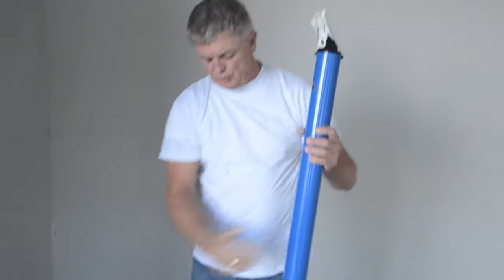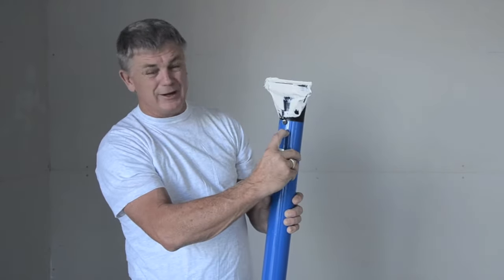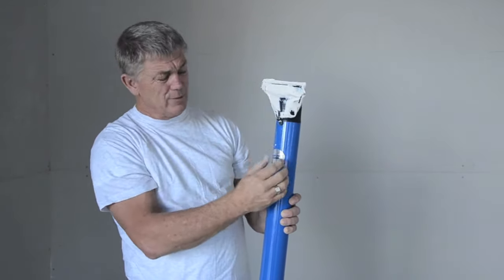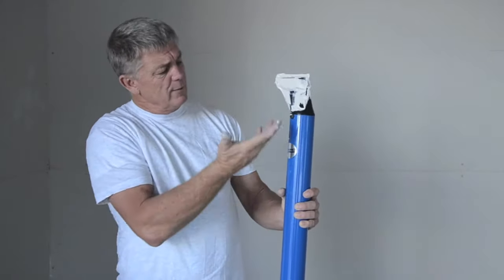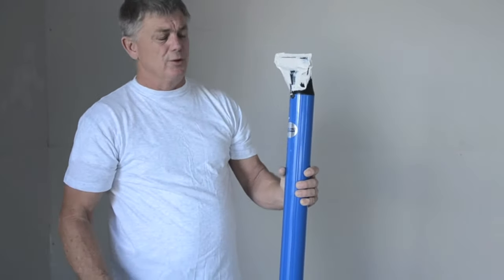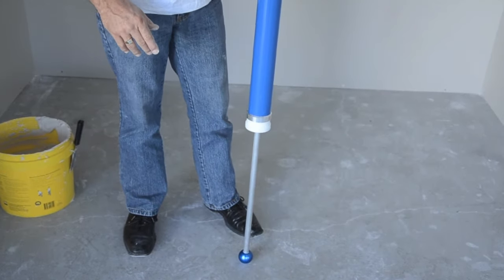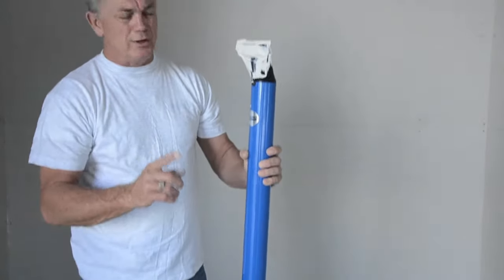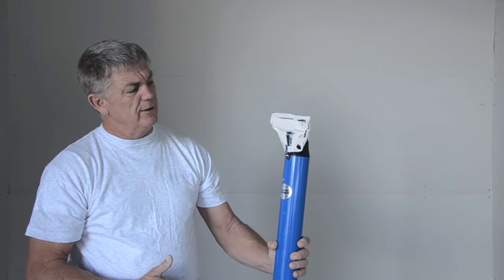Same with the compound tube — every time you put mud into it, your plunger inside, the piston, actually stops about here, so that gap is air. As you draw mud into the compound you've got that air pocket. What you're trying to do is, like burping a baby, bring the air to the top and get it out so when you're going along the joint it goes nice and smooth. You only have to do this once while you fill the tube; every other time you fill it from there on it should be pretty right.